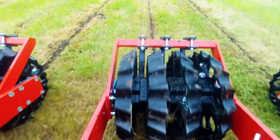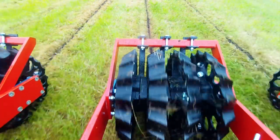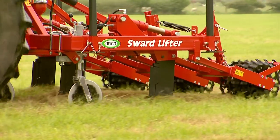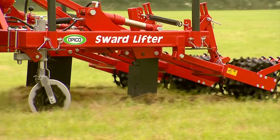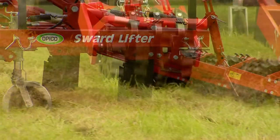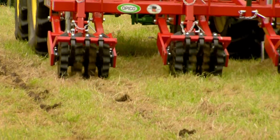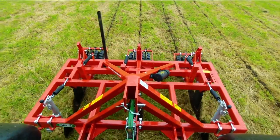An individual spring-loaded, four-section Prisma roller follows on from each leg. The rollers follow the contour of the field, perfectly gripping the sward gently and pulling the open slot together without smear or recompaction. Each roller is supported by two robust sealed bearings and three finger scrapers to keep the Prisma rollers clean for a professional finish.